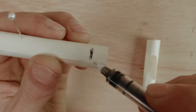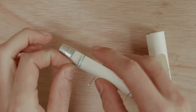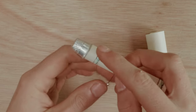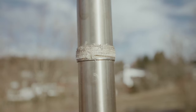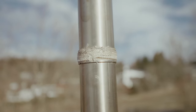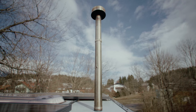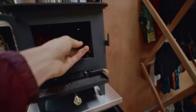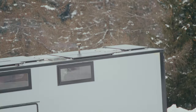On top and on the bottom of the inner pipe, we welded two rings, one centimeter apart from each other. In between this gap runs a furnace cord, which we glued on there. A furnace cord is available in many sizes — ours is 4 mm, so it fits nicely in between the 5 mm gap. The cord is used to guide and seal the pipe. It's not necessarily against smoke making its way through the gap, because the smoke is being pulled out anyway through the inner pipe by draft.